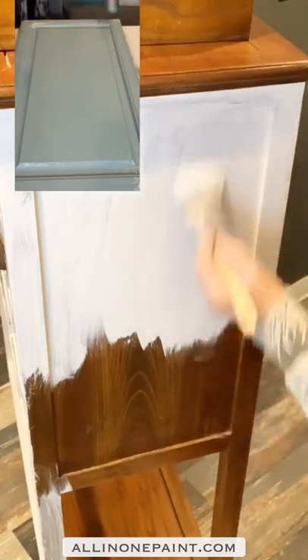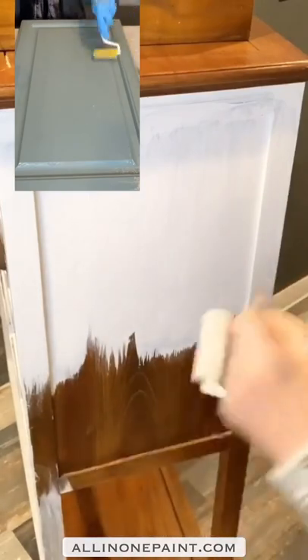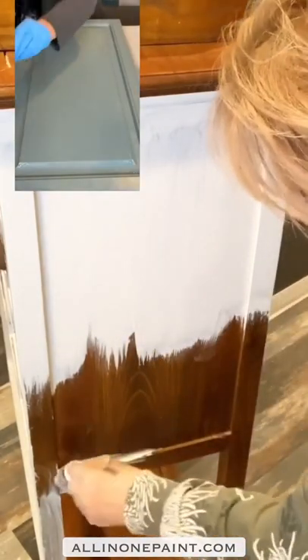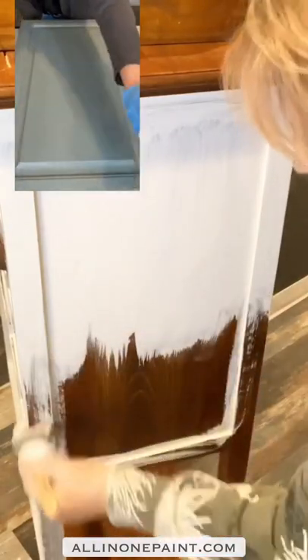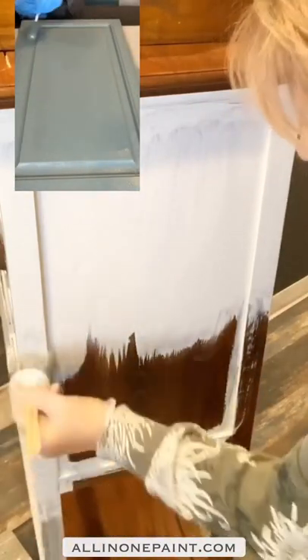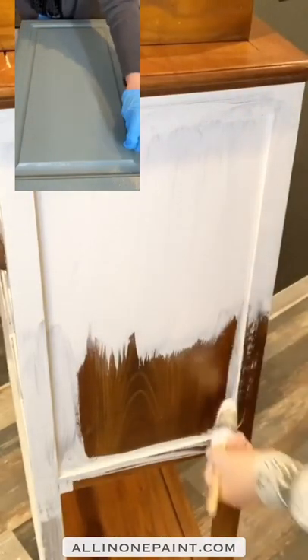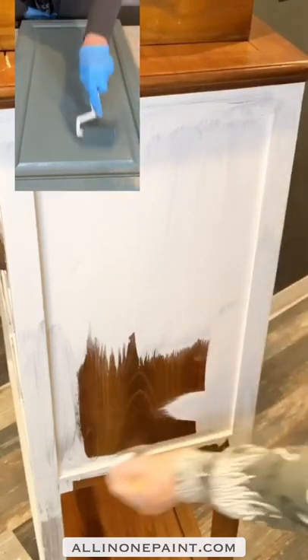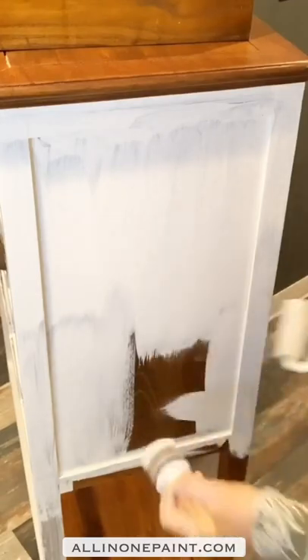when you go back through it to brush it or use the true applicator, there's nothing there to move — it's already dried, already stuck down. See how much paint's there? That will give you a better visual. Cut out around the frame, anything you have to poke the brush into, just push it in there, get it done right around, then go finesse the paint. Don't thin it so much — what gives you coverage is the thickness of the product. You have to have enough paint here to cover.